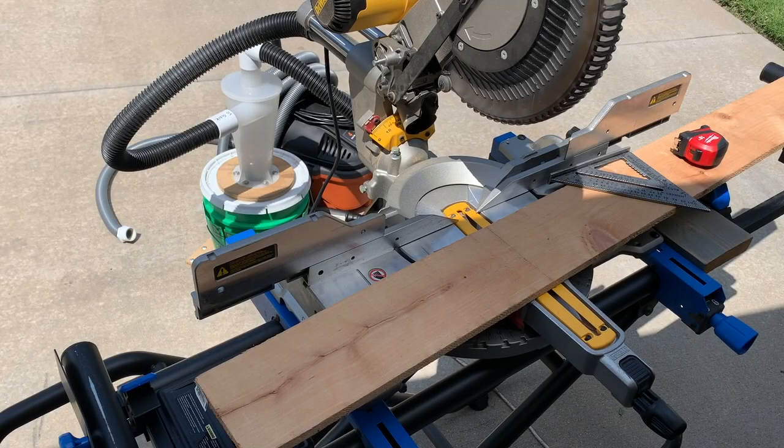My planter is 18 inches square, and the wood I'm using is just a dog-ear cedar fence board — it's five-eighths of an inch thick. The way we're building these, there'll be one overlap on each end, so we need to compensate for the thickness of the board by adding five-eighths of an inch. That puts us at 18 and five-eighths, but I want to give us some play too so it's not really tight, so I'm gonna go ahead and make it an even 19 inches.